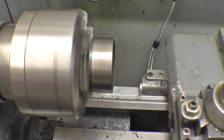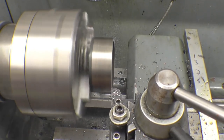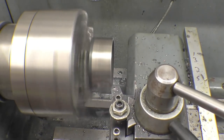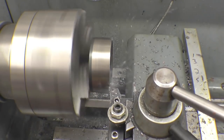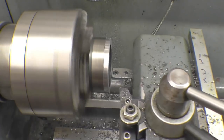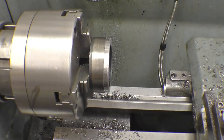I change a lot of bearings at work, wheel bearings in cars, and I often keep the outer tracks to use as spacers when pressing, but also they make good parallels because that ground size is a lot wider. Three and a half mil to come off there.